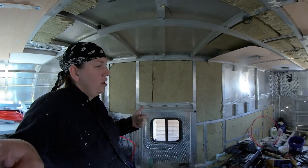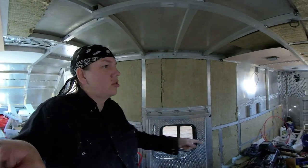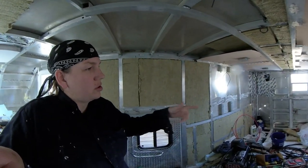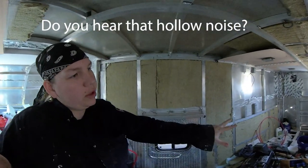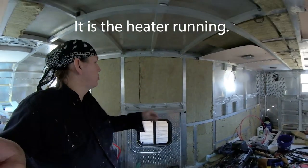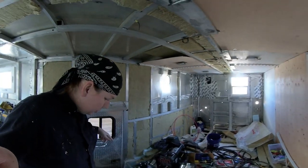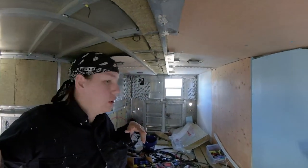I'm going to go ahead and add some of this AC line in the walls, because I know I need electricity there, and I know I need electricity there just because of the nature of everything. We also might cover up these holes and insulate that, and just use the bolt through on the bolts that we need to bolt through. Because there are the frame members, we won't have foam on it yet, but the frame members can go insulated in between, which will help. And if we can get this rock wooled and foamed up here, and get this middle section foamed and rock wooled, we can lay up the second roof on that and have that thermal space that we can pull the heat up.